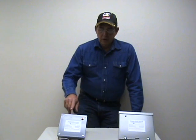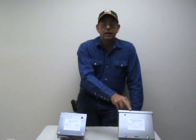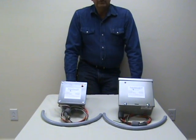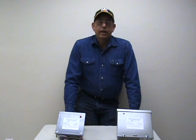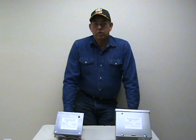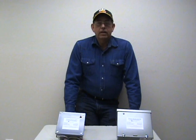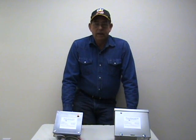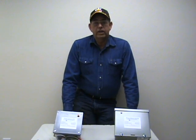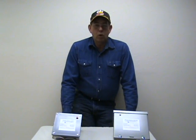You are looking at our 2401 standard unit, and you are looking at our 2401M Mega Saver unit. We also manufacture 2 commercial units that are larger for 3-phase systems. Those are the 2803 and the 28036 units. The 2803 units are for a 100 to a 400 amp 3-phase panel, and our 28036 is for a 600 amp panel. Those require a triple pole 30 amp breaker in your panel.